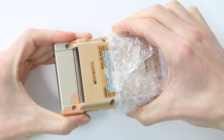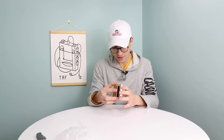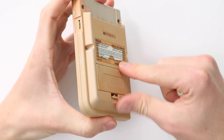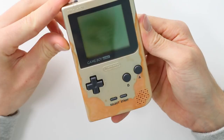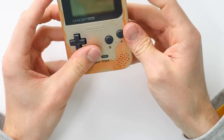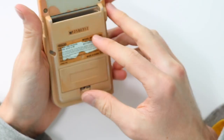It's got the usual problem with the LCD screen. This was actually a gold Game Boy Pocket, but as you can see, the paint has just completely rubbed off. Let's go ahead and pop the batteries in the back - I'm mixing batteries because I enjoy living life on the edge. I can already see a little bit of corrosion on the battery terminal on the inside, which is never an ideal sign. We're not getting a single thing out of this - I'm trying to turn the contrast wheel up and down, but nothing at all. The power switch is being wiggled. It hasn't got a power indicator because it's the slightly earlier model. The screen lens is in really good condition though, which is nice.